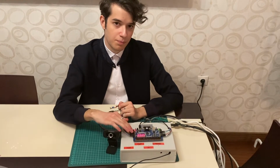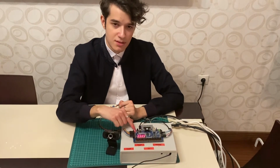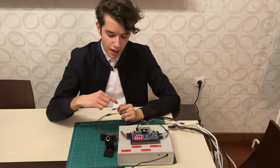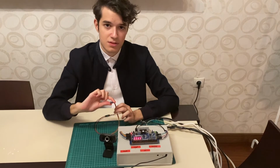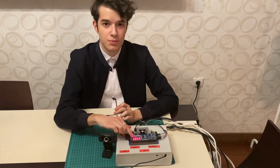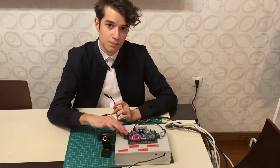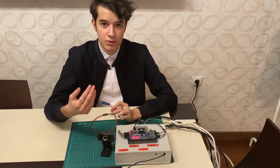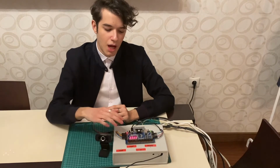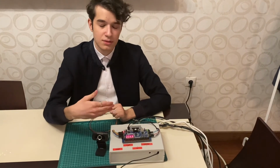Now, what I want this board to do is basically, when I turn the switch on, I want this board to simultaneously turn on the power and pressure delivery systems and begin a countdown here. And after this LDR sensor sends a logical value of 1, I want this countdown to stop and indicate that the breakdown condition is reached. And after that, I want this system to turn off for a moment, which will give the operator enough time to set new voltage values. And after the operator sets the new voltage values, I want this system to continue its loop, reset the timer, and start the system.